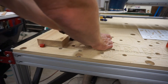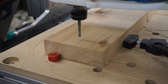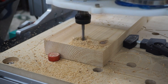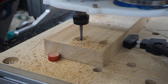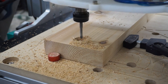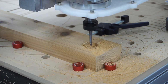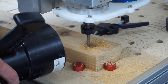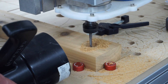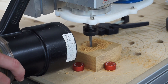The holes in the seat slats — a larger hole cut partway down to accommodate a large washer, and a smaller hole cut all the way through for the bolt that is firmly affixed into the concrete leg. I set the files up for this to cut on the CNC so everything would be repeatable, although this could easily be done on the drill press. The 2x4 stretcher underneath the bench just has one size hole that's cut all the way through.